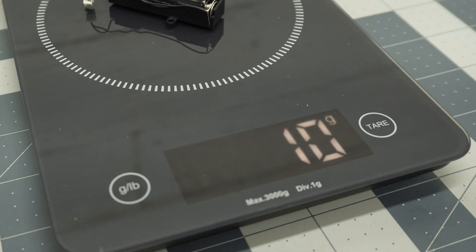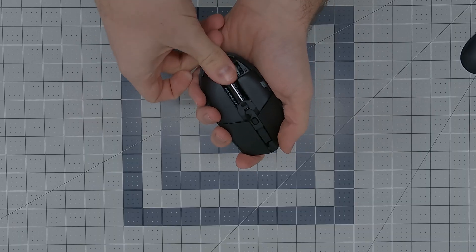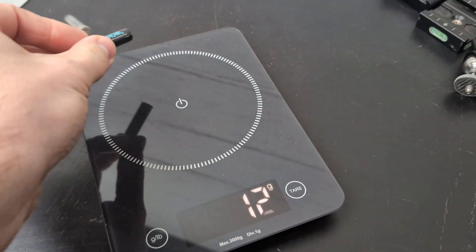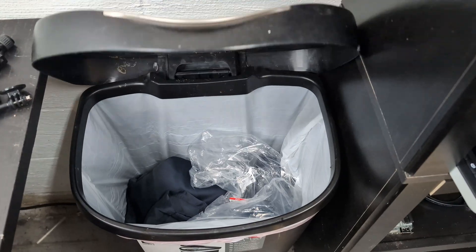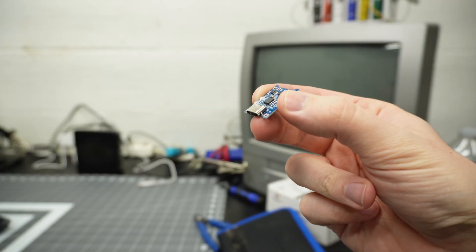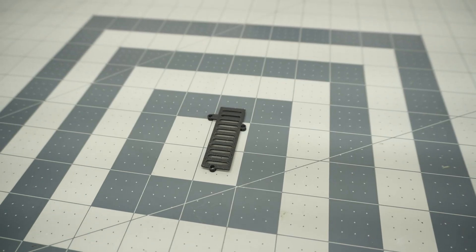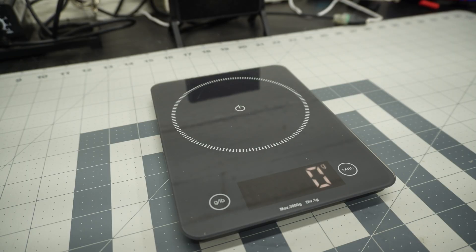The only thing left I could think of to remove was the AAA battery — this thing has got to go. Not only does the battery weigh down the mouse, but the sled, contacts, and connector are all added weight. Originally the G305 was supposed to use a single AA battery, but I modified it to use a much lighter AAA. That's when I realized lithium batteries were a lot lighter than alkaline. But even with the lightest lithium AAA I could find, it was still way too heavy to come close to reaching my goal. So I got to thinking: what if I could use a cheap rechargeable drone battery to power the mouse? They are designed to be lightweight and tiny after all. I just needed to figure out how to charge it since it wouldn't be removable anymore. Luckily, I had a few USB-C BMS charging modules, and after designing a new super lightweight mounting solution for the battery and BMS, I weighed everything together and compared it to the AAA battery and hardware. As I had hoped, this should be more than enough weight savings to meet my goal.